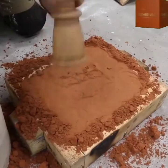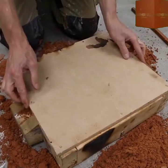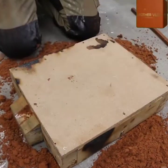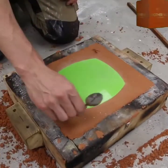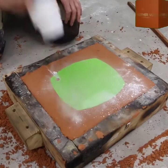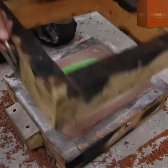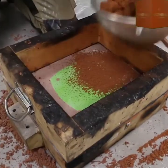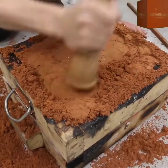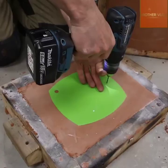It's now being dusted and embedded in fine red casting sand, that dusting keeping it from sticking to the sand. Time to seal up this half of the cast. In this case the backing is flat as it's plaque style, so simply some dusting, brushing the excess away, then the second half of the box and a whole lot more of that fine red casting sand go down and are pressed into place. Hopefully every last detail of the original is captured.